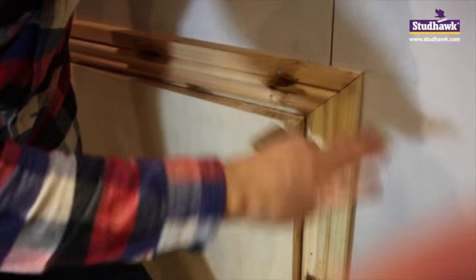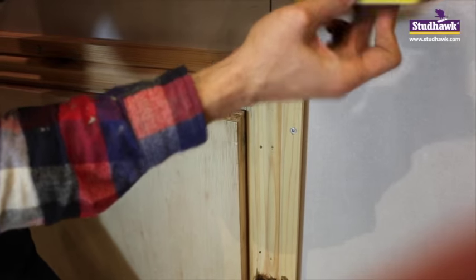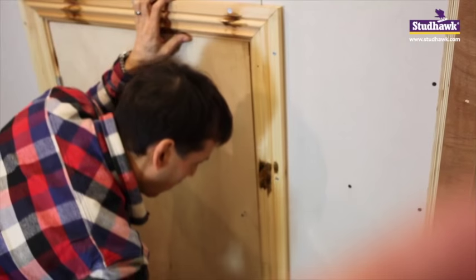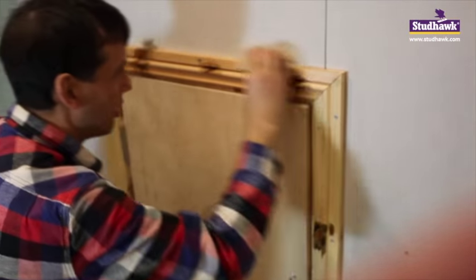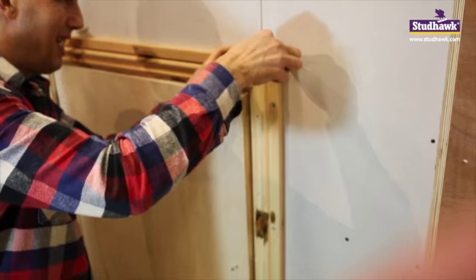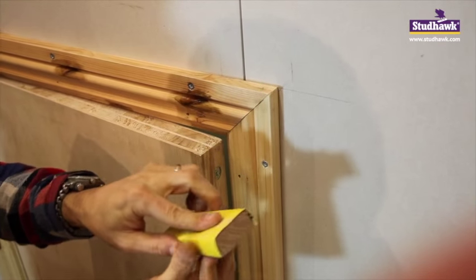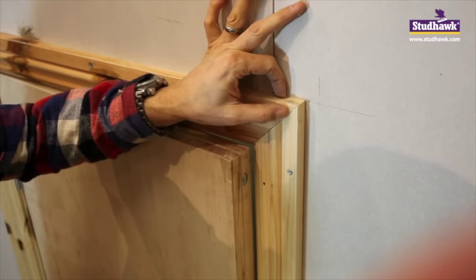It's new woodwork. Before we paint it, we need to give it a sand. We need to give it a pencil round, like a worn pencil. And what I want you to do is count how many passes — as decorators say — you give it with the sandpaper. So, one, two, three. Have a feel. Feels quite nice. Let's give that one three. One, two, three — so that we're getting the same finish on both pieces of timber. That little edge there. Touch the corner very gently. Across these two faces — that's where the block comes in handy — so that they're perfectly flush for paint.